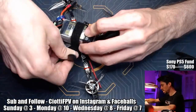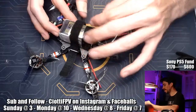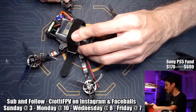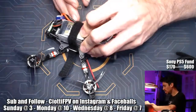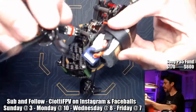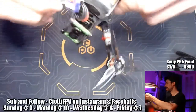What if I get it up here? Yeah, this is going to give me a little bit more clearance. And maybe I can even tuck this. One of the local guys actually just lost a rig yesterday, probably in plain sight, because the battery unplugged. Preventing your battery from unplugging is a really big deal. You will absolutely lose a rig at some point if you do not pay attention and secure your battery, or just think about how your battery is in here and what if it comes unplugged. That's fine. I'm okay with that amount of clearance between the prop and this balance lead protector. Not to mention that even if the prop does bend up, it's not going to hit this.